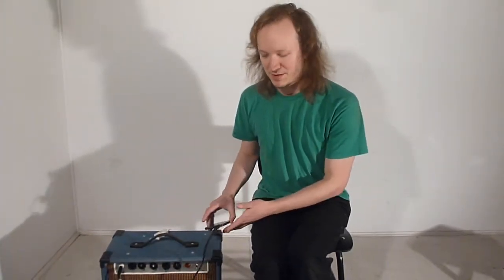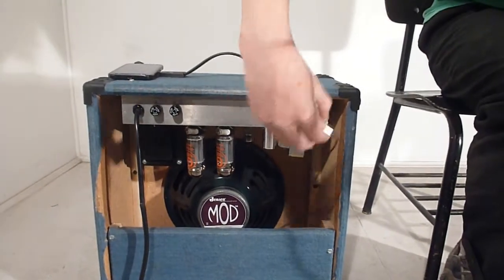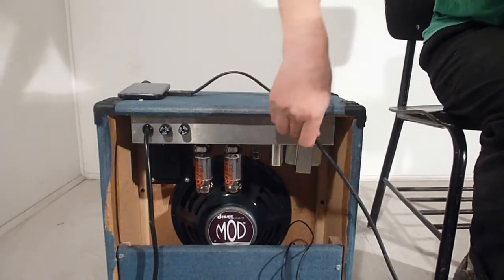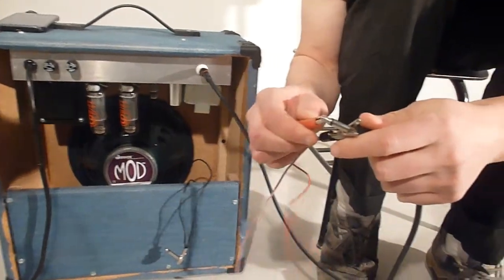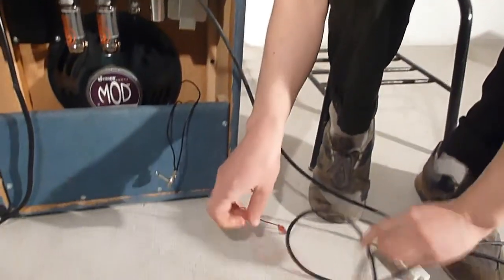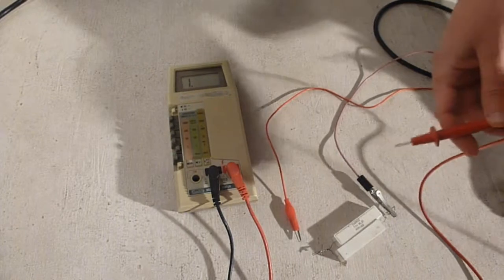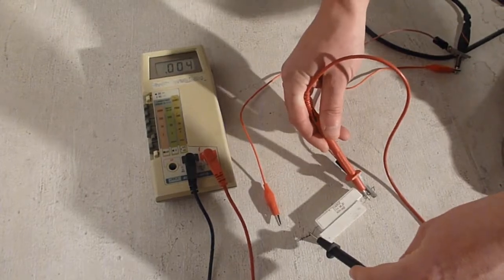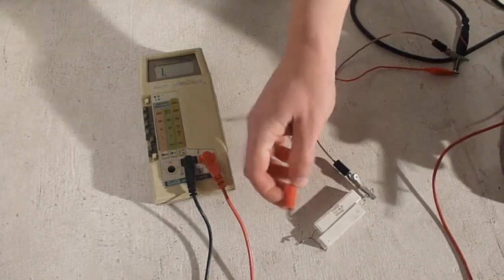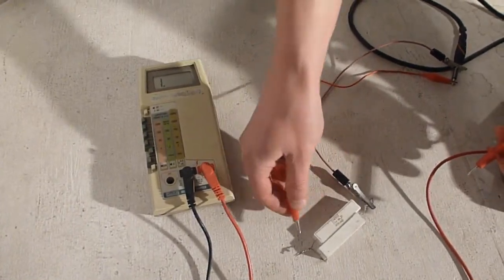Then turn the amp off — it's important to turn it off now. Unplug the built-in speaker and replace it with the resistor pack. I'm unplugging the speaker and plugging in a speaker cable, then connecting that cable up to some alligator clips and connecting them to the two ends of the resistor. Before connecting everything, it's a good idea to check and make sure your resistance is correct. This is a 4 ohm amp, so I have a 4 ohm resistor. You have to check that without the alligator clips connected, because the resistance of the transformer will throw your value off.